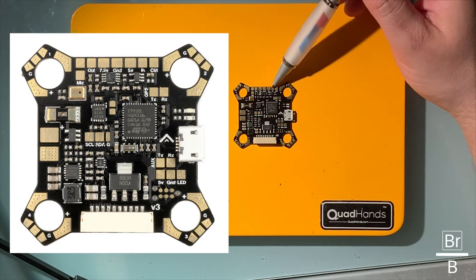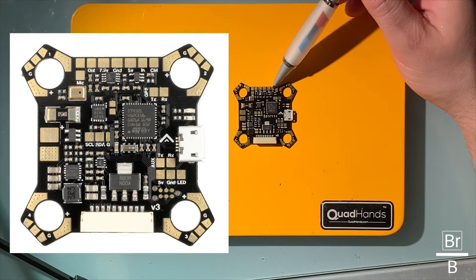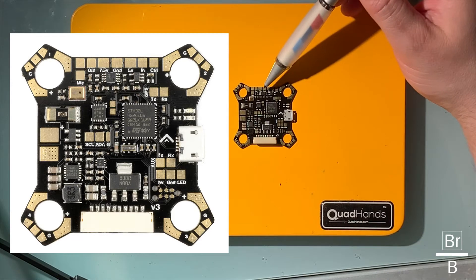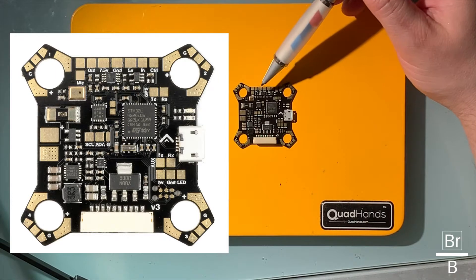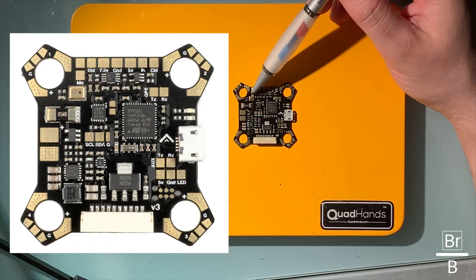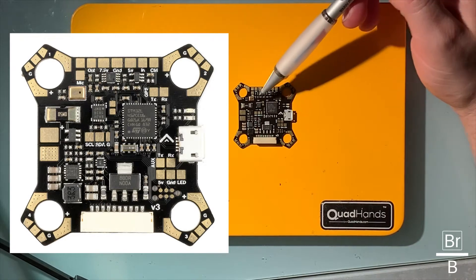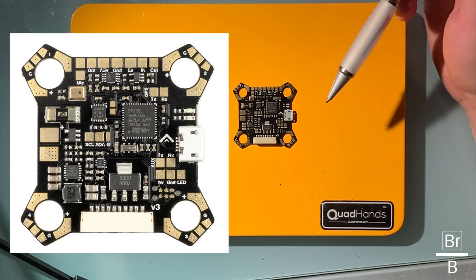You've got 5-volt ground, and input from the camera, and then control — camera control here. This is your video in, 5-volt ground, common ground. So you can get your VTX stuff going here as well. 7.5 volts — and knowing ImpulseRC, this is going to be filtered and regulated. 7.5 volts for your VTX, your video out to the VTX, that's VTX control smart audio. And if your VTX has a microphone, pass that along as well. This little component right here should be the onboard microphone for this PDB, which is great.